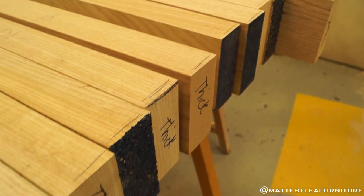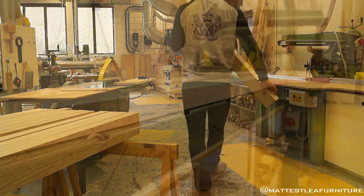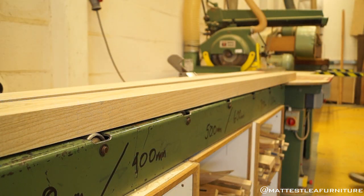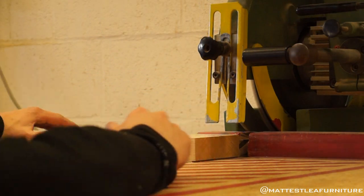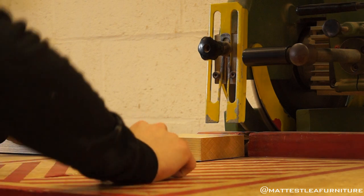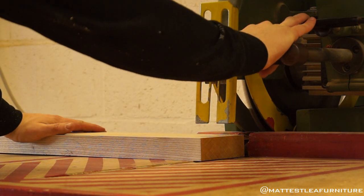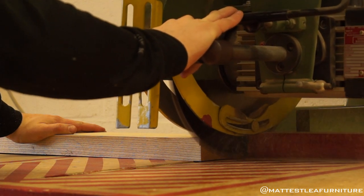And after numbering all of the components, I was able to cut all of those ends off that were either labelled or were painted at the sawmill, or cut off any disgusting grain and basically get those ends relatively uniform. Ideally I would have done this on the panel saw, but it was being taken up at this point so I decided to do this on the radial arm saw. It's something I'll be cleaning up later on in the project anyway, but at this point I just needed a relatively flat reference point to work off.